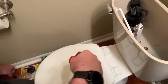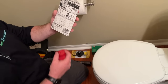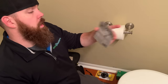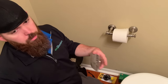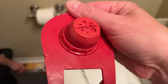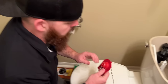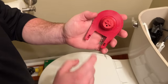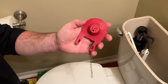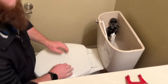We'll do this by a system of trial and error because I don't know the specific Sterling model this is. They have a wide range of hole sizes calling for three, two, and six. We'll start at six and then go down to three and then two to find out where the best flush is for this toilet. Setting six is the smallest pinhole, which is going to make it float longer. Setting three is about medium size, and two is slightly larger than that.